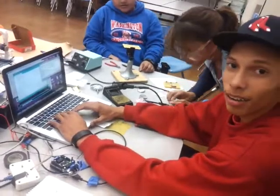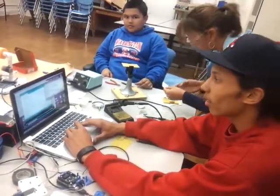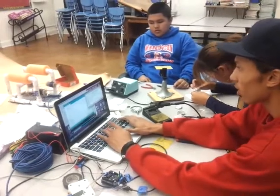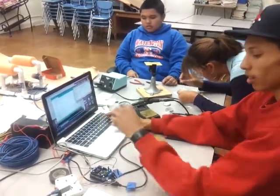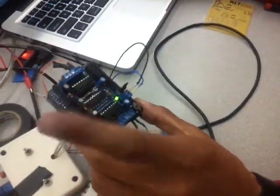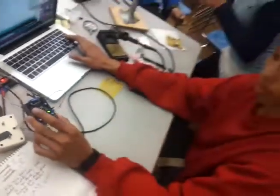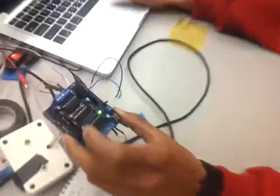That is our hacked model of the Sea Perch. Now, how many motors can you run simultaneously and what are the dangers? We can actually run all three motors simultaneously, as you can see. But the problem is our motor shield will eventually overheat because it's not made to run three motors at the same time for very long — as you can see, all three have already started to heat up.